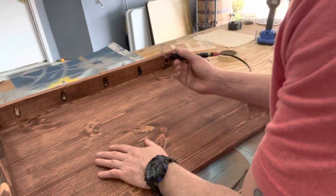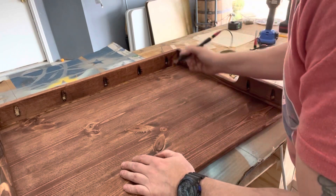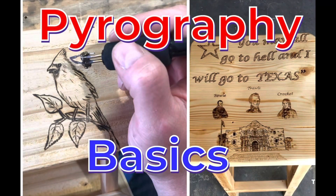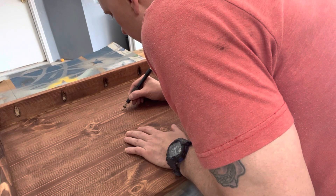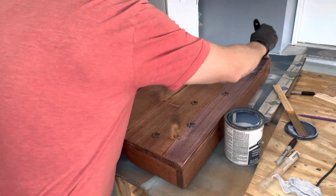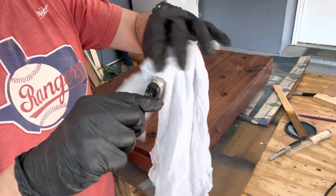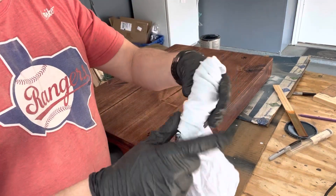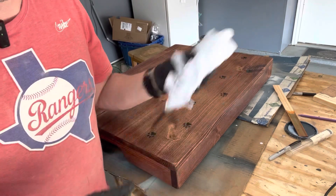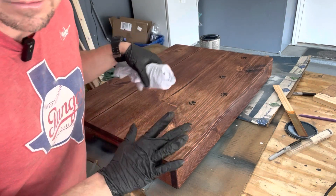Time to leave my mark — I use a wood burner to do that. If you'd like to know more about pyrography or wood burning, check out my other video. For the final finish I applied three coats of polyurethane. A little trick: between coats, wrap your brush up with a damp cloth and put it in the fridge — it stays good until you want to put your next coat on. Water-based, not oil.